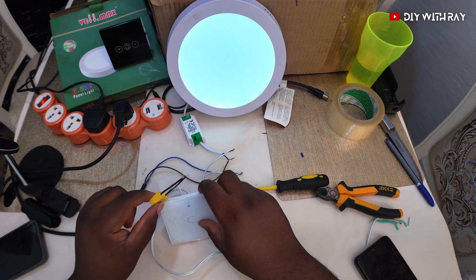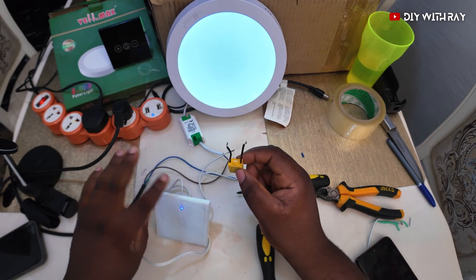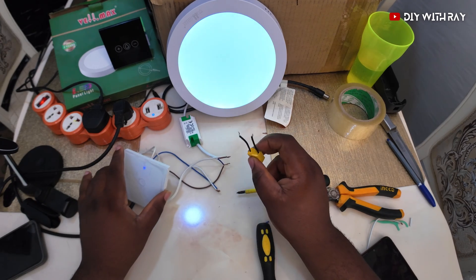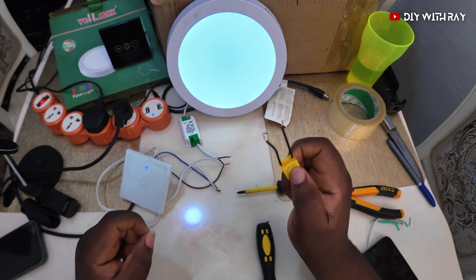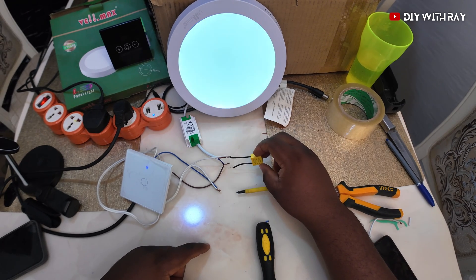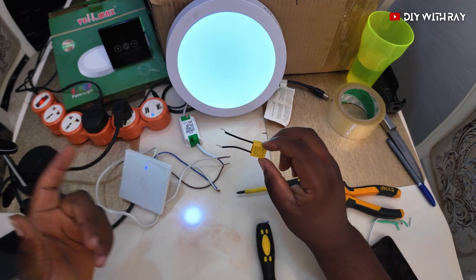The way to solve this issue is to make use of this capacitor that comes with these switches. Connecting this capacitor is a bit tricky but once you understand it, you'll have it forever. You can't connect it at the switch location — what you need to do is replace your analog switch, screw it in, then go to your first bulb that is flickering and connect this capacitor in parallel with your choke or bulb inlet. This flickering issue occurs mostly with LED bulbs, and LED bulbs use a choke, so you connect the capacitor in parallel with the choke.